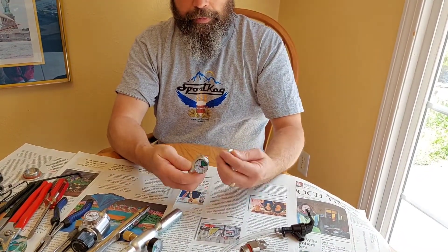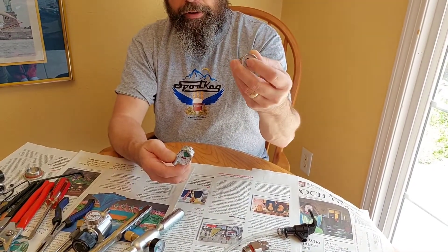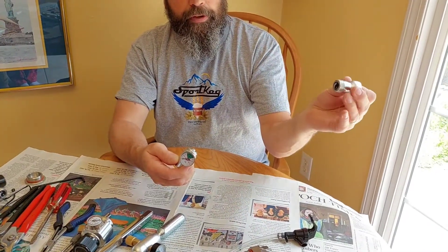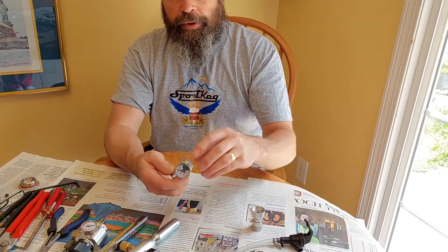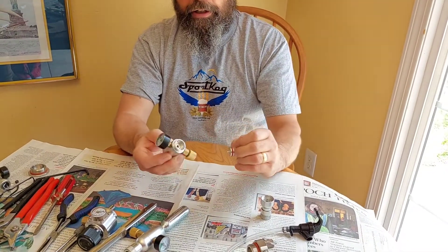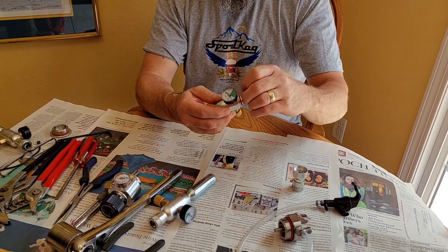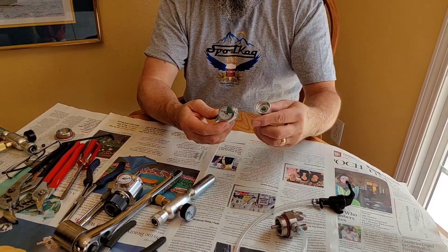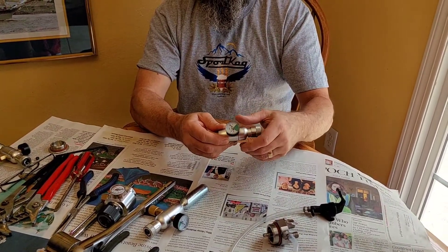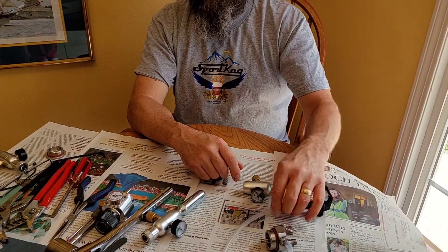This unscrews apart. You'll see there's a big spring and a rubber seal on the inside. This whole assembly actually comes apart if you ever need it to. Inside this chamber you can get beer, and if it dries up in there it's sticky, so the piston can stick. What happens if it sticks is the pressure may not be regulated and it may go full pressure right into the hose, and the hose could blow.